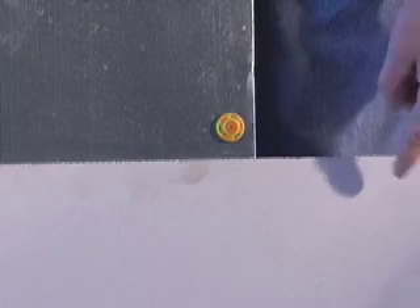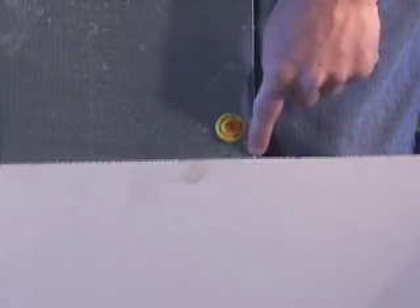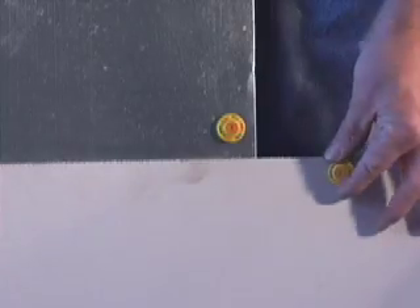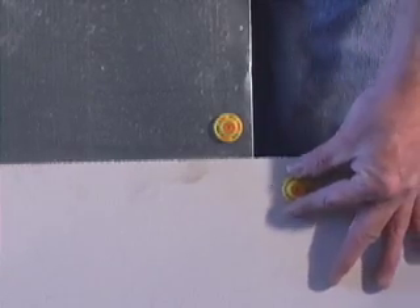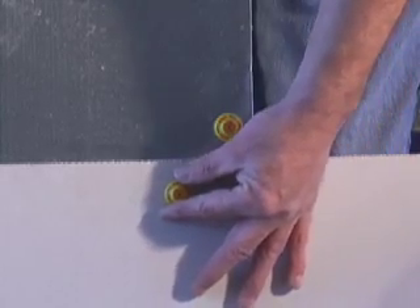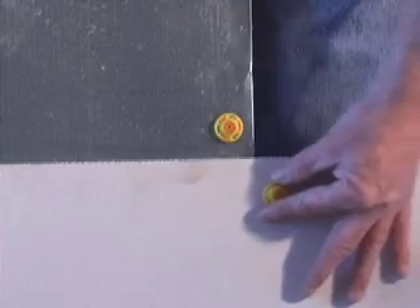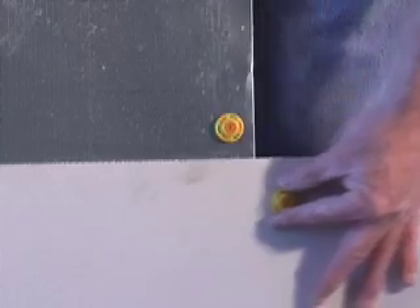A conventional stud finder — as you come across the front of a heat duct, it will register and show that there's something there, possibly giving you a false reading. Without using the holder, I'm just going to do it by hand. As I come across the drywall and get to this point, even though I'm right against the drywall, it's not picking up that heat register. It's only going to pick up something that's really close to the surface.